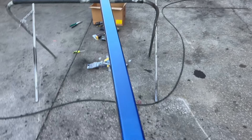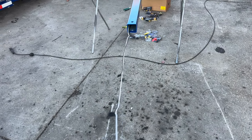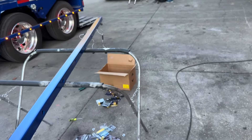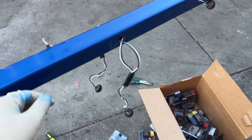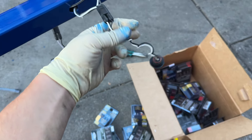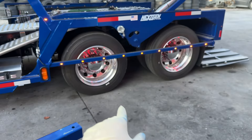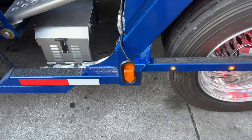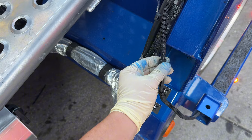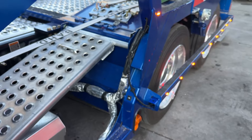This is how we do the wiring for these poles. We have a long wire with these kind of connectors — I cut off 15 of them so that there's 15 of these connectors. I fished it through this pole to that side. You basically connect them just like this. Then when you're done with all of your holes, you shove them back in there, put this rubber grommet back around, put the light in. When it's on like this, you have a wire that's going to come out right here. You plug it up into this kind of connector so that you can unscrew this later and take this whole pole off without having to cut your wires.